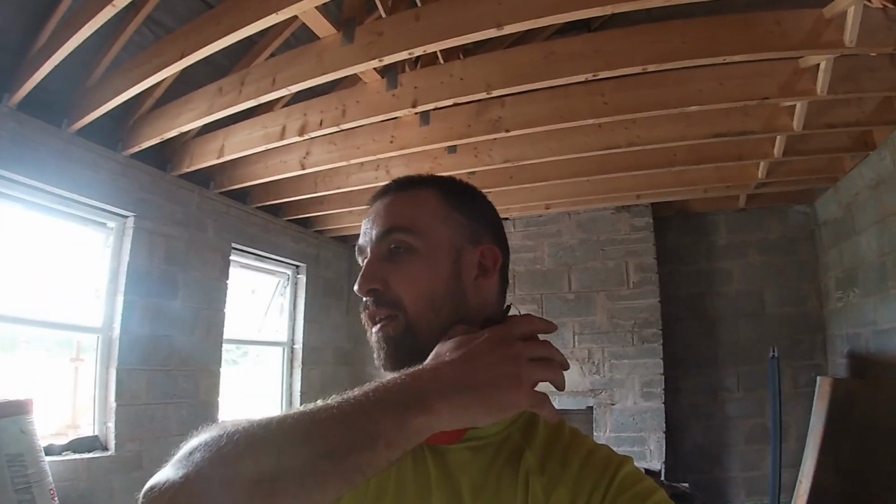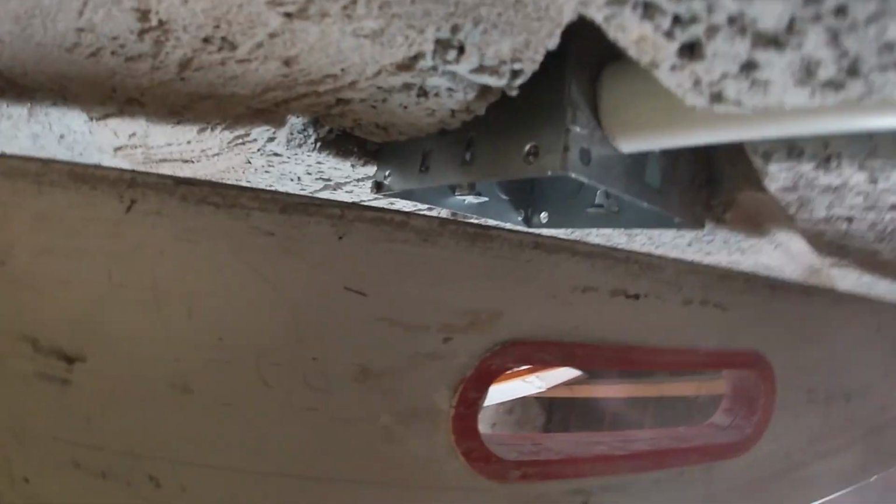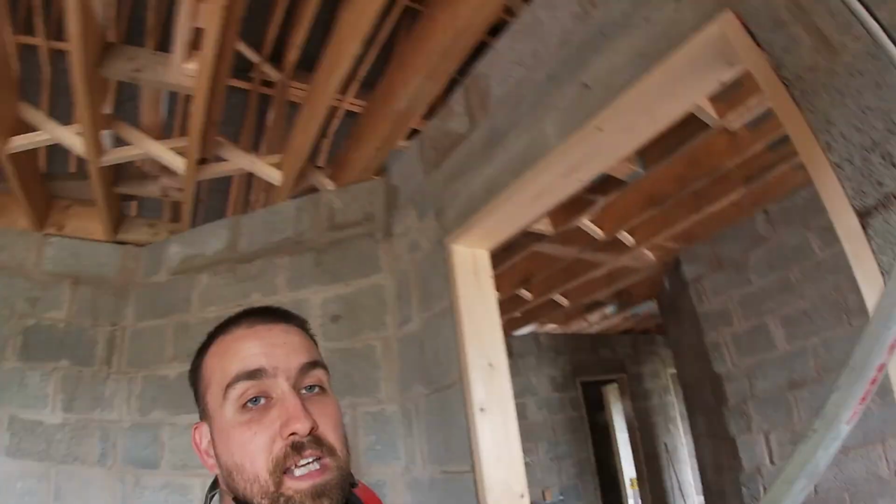It's perfect. The next dead walls, I might try and get them in a wee bit deeper. If the wall is actually straight, I don't need to go so deep with it, because with the render it simply won't need to. But the next frame walls, you can see, put a straight edge on there, and I've still got plenty of clearance for plaster. But again, there's still a nice wee catch there just to catch the edges and give the plaster something to grip to, help on the box.